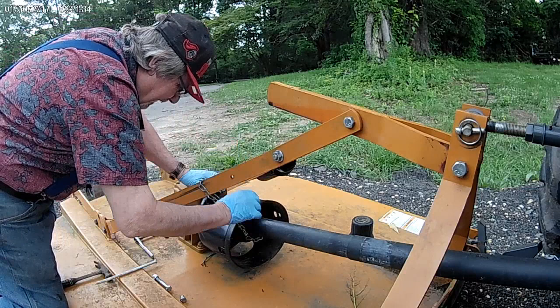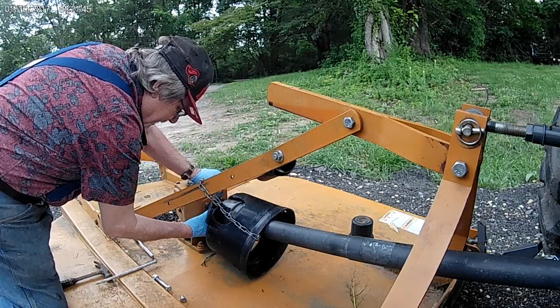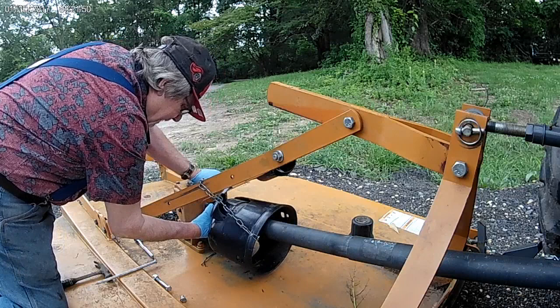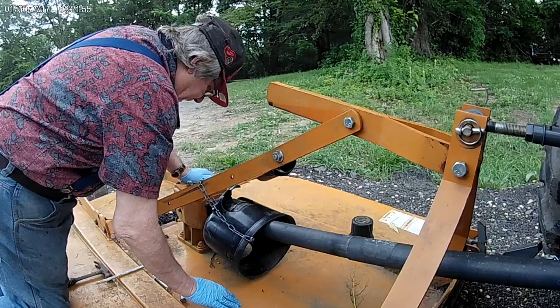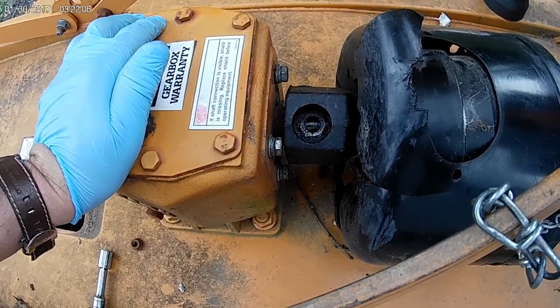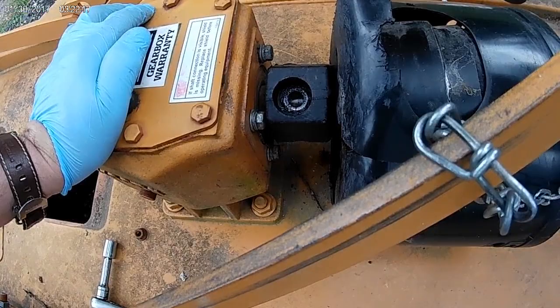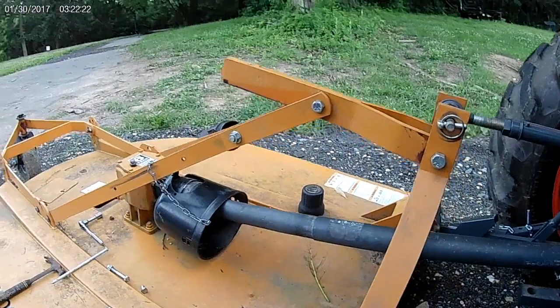The next thing you've got to do is find where the hole is. The bolt is broken so you have to locate the hole. You can see in there — that's the shaft — and right now I'm not where the hole is, so I'm going to have to turn the PTO shaft around. It's probably on the bottom. You'll want it kind of on the side so you can hammer it out if necessary. This is when you have to go underneath and turn the blades.